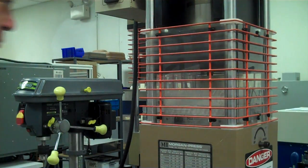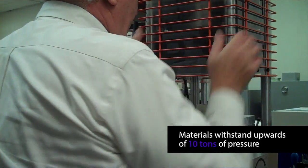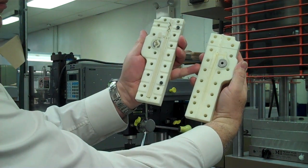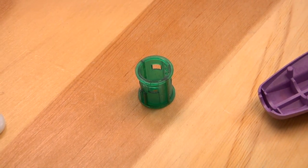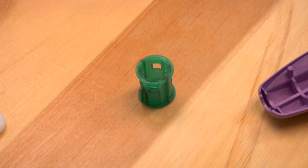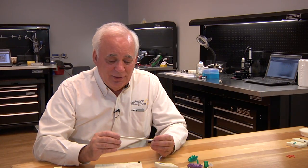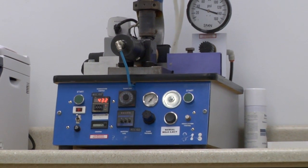These printed molds we clamp with about 4 to 5 tons of pressure, so they don't flash. We don't have to trim parts when we're all done or anything else. We pull them out of the mold and we ship them. The material is very good under compression. But to be able to do a part this thin, this long, even in metal, would have been extremely difficult.